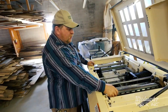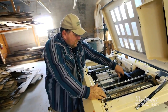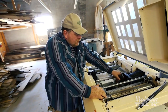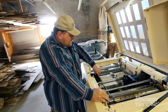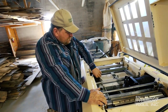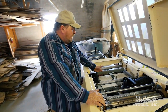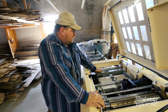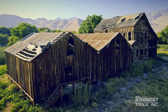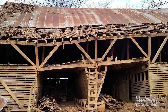I have a top cutter here with two knives in it — you can also put your shaper blades in here. This is the left-hand cutter; it has planing knives in it, and it's also where you insert your shaper blades and tongue and groove cutters. This is the right-hand cutter; it has planer knives in it currently, and you can also put shaper blades and tongue and groove cutters here. This is your bottom cutter in the base of the machine — it has two adjustable knives in it, and there's also a place here for shaper cutters.